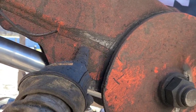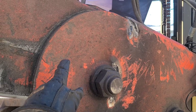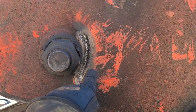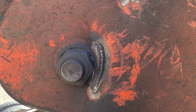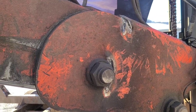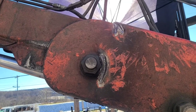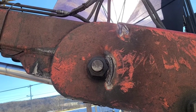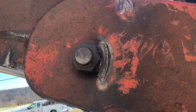Right on the other side of the plate I'm welding on is a part that's right against this plate, and the way this hinges, it has to move freely. We all want deep penetration, but if you don't pay attention and you gouge it out so much and weld in so deep that you weld this piece to that piece, you'd have a major problem. A novice welder, first time working on something like this, might accidentally do that.